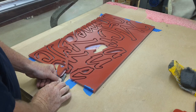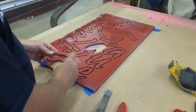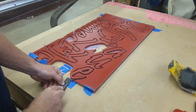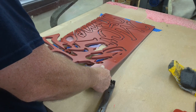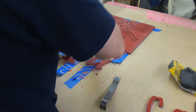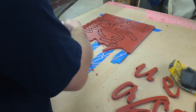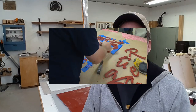At this point I'm taking the letters and the rest of the material off the machine — it's been about an hour and 40 minutes. I adjusted and played with speeds and feeds a little as it was going, but my recipe is pretty much spot on. The letters are all completed. There's a little bit of a burr on the bottom edge, but I'm real happy with that. The tramming I did on the head has been really awesome and taken care of everything I needed.